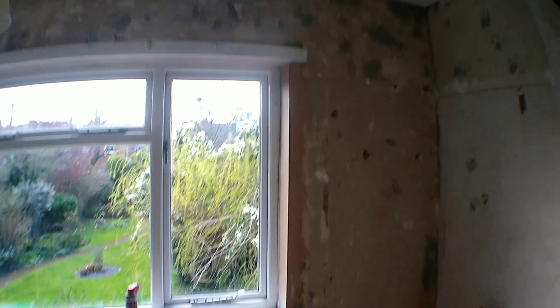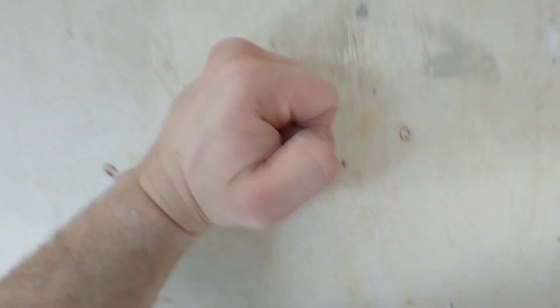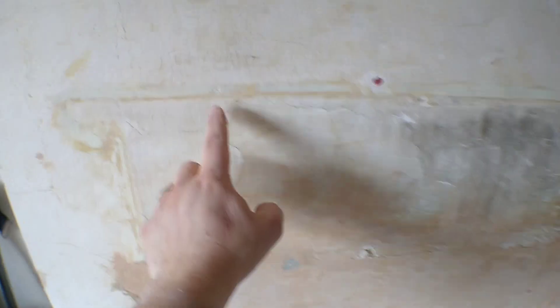I'm quite thorough with taping and meshing. Let me show you this one — the paper has been removed. The laborer is working his way around the rooms taking all the paper off. You can see the state of some of these walls — been patched up with one-coat plaster, which is this gray stuff, gypsum plaster which is the pink stuff. The light gray color is the original lime skin, and the reason we're meshing everything is because all these little hairline cracks tend to come back through if you don't mesh.